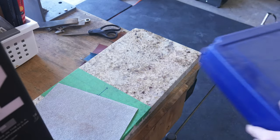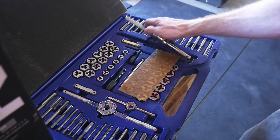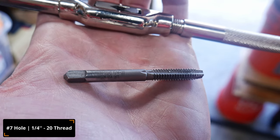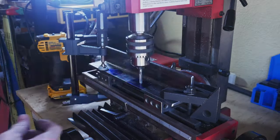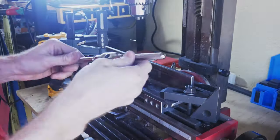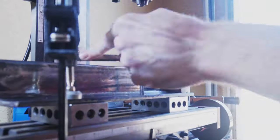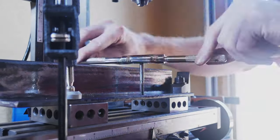Here's a pro tip: when you are trying to tap a straight hole and you don't have a tap follower, you can use your drill press or your mill to manually start the tap in your drilled hole. Drill your number seven hole, put your tap into your chuck, put some tension down onto your workpiece, and start the tap by hand. Once you get it started, you can loosen the chuck and then finish out with the appropriate tools.